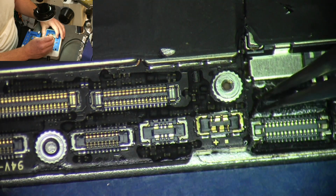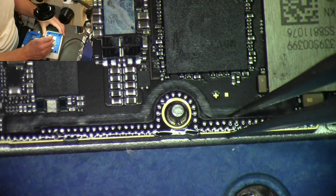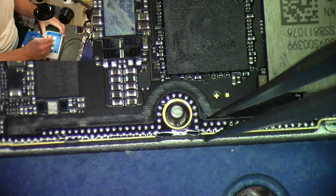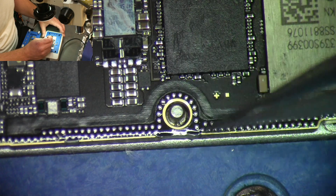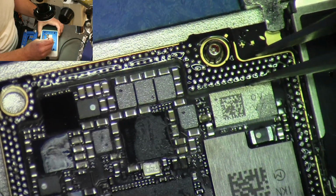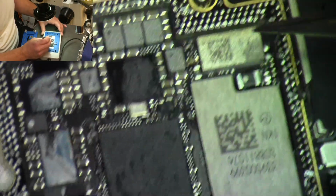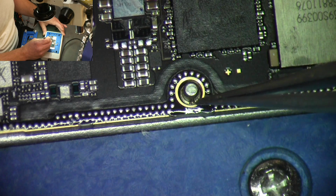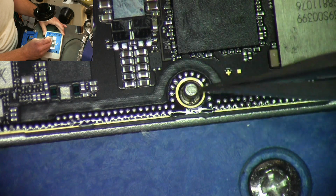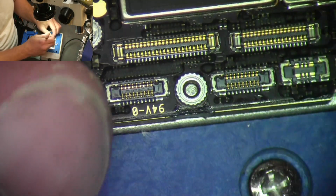And you see how the bottom board is moving. Let me take this off. You can see how the bottom of the board moves on these studs. There's quite a bit of slop in it there. And whenever you look at how close these pads are, you can see how much slop there is here in these studs. And then once you get on the second board, you can see that these studs get even narrower in diameter, and so that allows the top board to move even more than the bottom board.